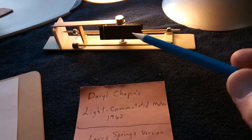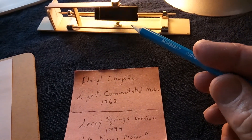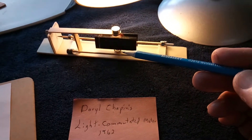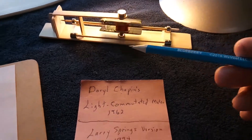This was a lot harder to do, and I do not recommend building a Mendocino motor with just two panels — it's too hard to get it to work. The light has to come in just right, it doesn't self-start, you have to hand-start it, and it was very finicky.